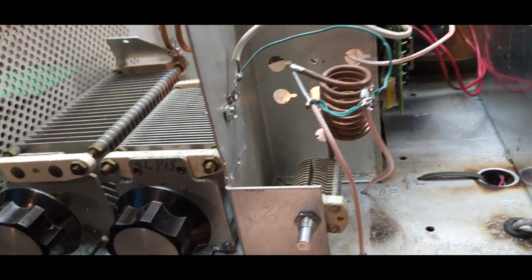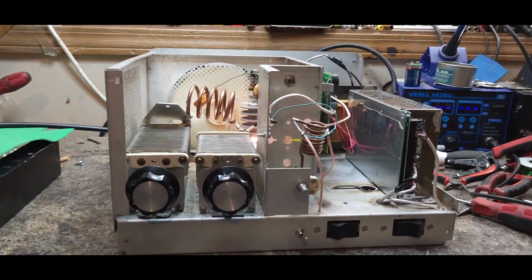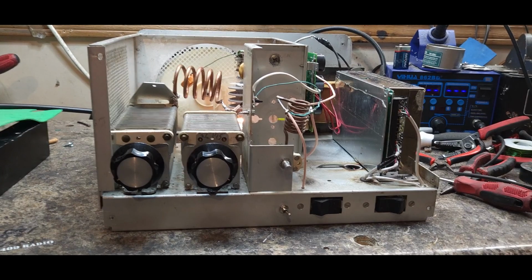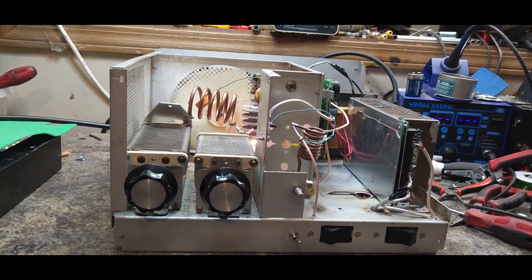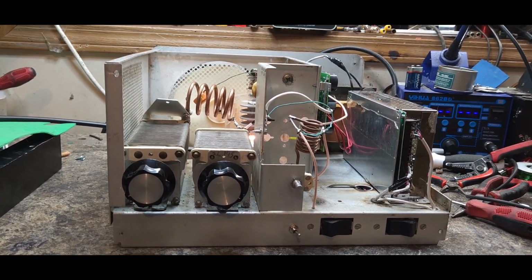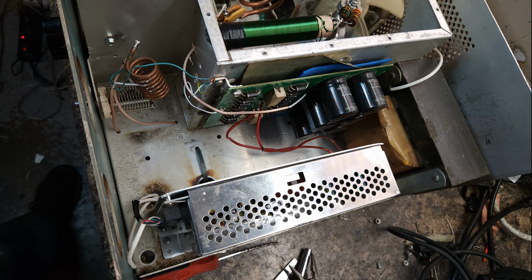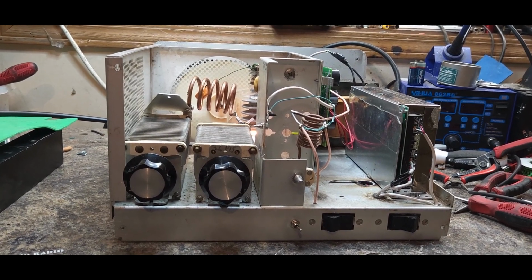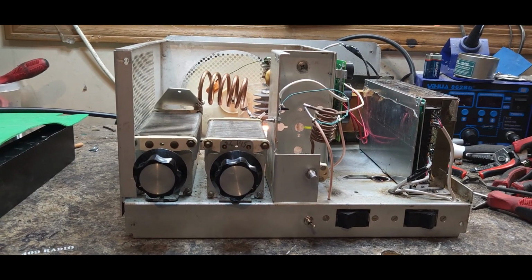Now you gotta keep in mind, this tube wants up to 50 watts of RMS drive. And the situation this box is going to doesn't warrant balls out operation. He's looking for clean, modulator style audio, and that's pretty much the way we did it, to do whatever he's going to do next in his chain.